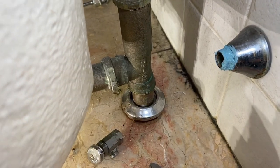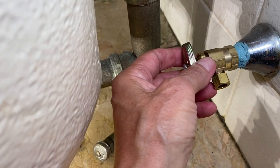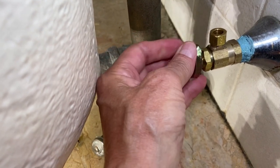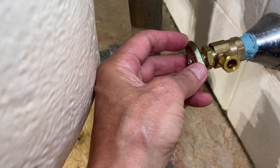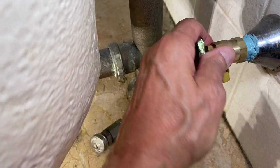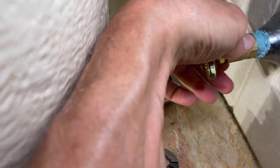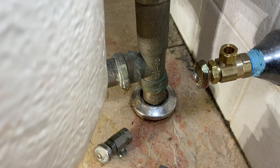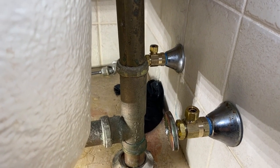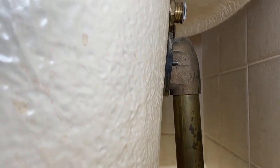What I generally do is use my blue monster Teflon tape in a clockwise fashion, followed by my mega lock — especially on these old connections. That's copper tubing coming out of the wall, so this is a semi-modern setup. I don't know when this job was done, but it was time to get these new valves on so I could get the water back to them — they were concerned about how long the water would be shut off. After getting the water back on, I proceeded to break down the actual faucet and get it off.